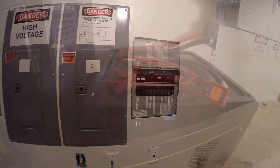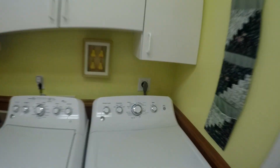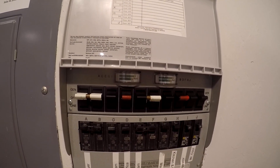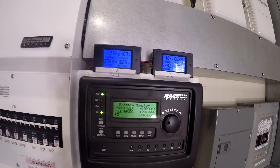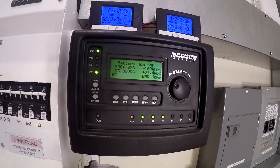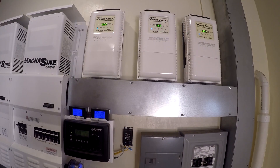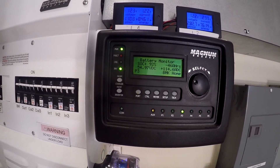Let's take a look at the dryer — switch to solar, turn it on. Look at the meters from the dryer — pulling down a lot of solar. The dryer is using 6,000 watts, it turned just about everything else off. We've used about 14 kilowatt hours so far in the house, and we've charged our batteries from about 38 to 82% and we're still charging. It's about 1:30 — still pulling about 7,000 watts of solar, putting 114 amps into the bank. We're at 92%.